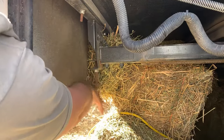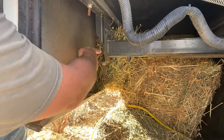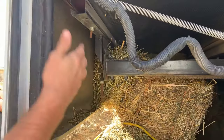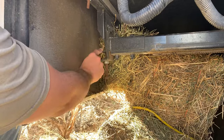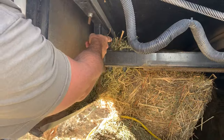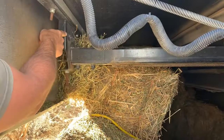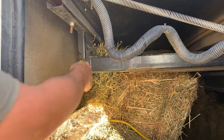What we've got here is your height adjustment bolt. This is going to put pressure and hold up this bracket that is attached to the outer edge of the slide. What we're going to be doing is loosening this bolt so that it drops this down, but in order for that to work we've got to loosen these two bolts on each one of these rails, because this is how it slides up and down — this is how you adjust the height. There's a little channel for these bolts to slide in right there on that bracket.